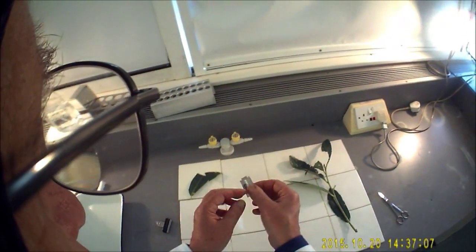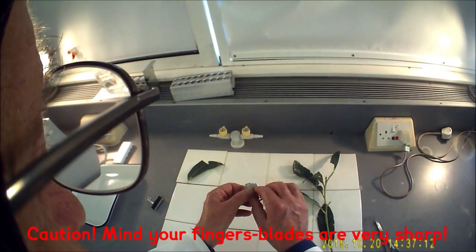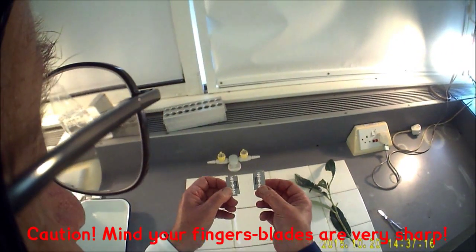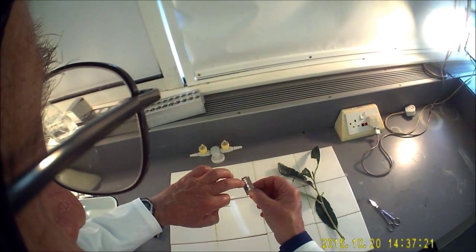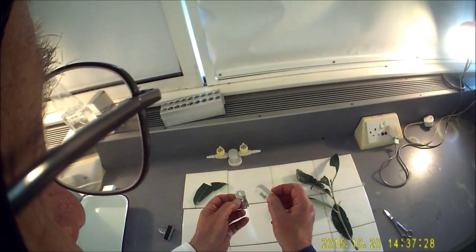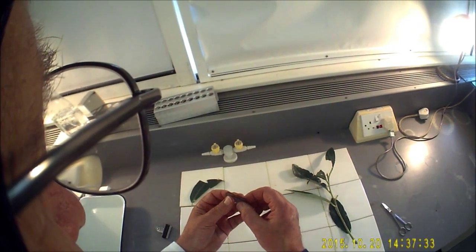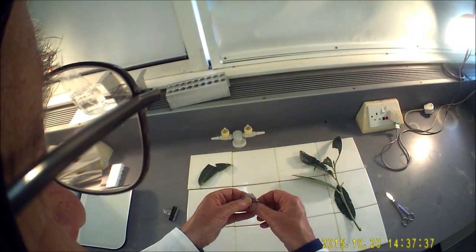You need a bulldog clip and two double-edged razor blades. What you then do is place sellotape on the inner face halfway down of each one — sellotape from there, up and round the edge of the blade, and the same on the other blade. So that when the two are placed together, in theory, you have a 100 micrometer gap between the two blades.